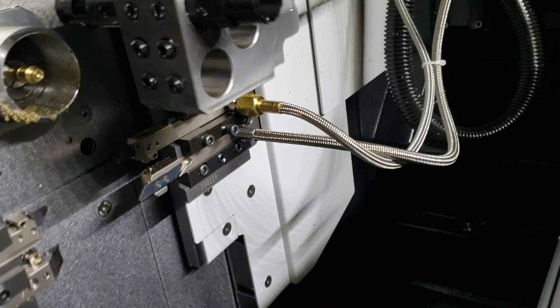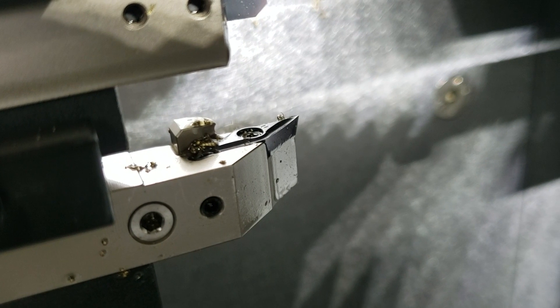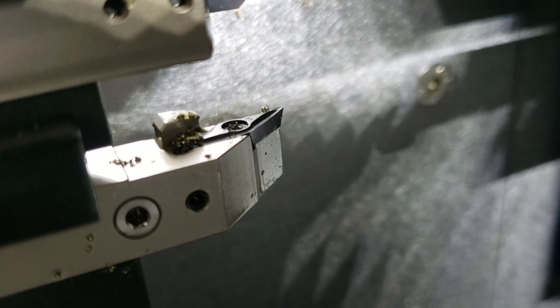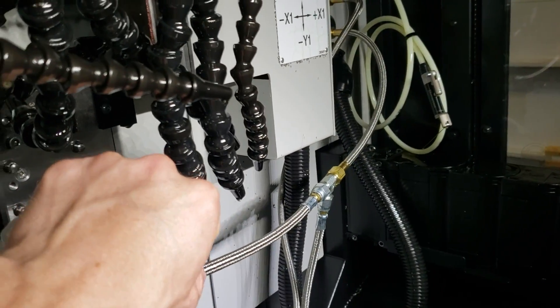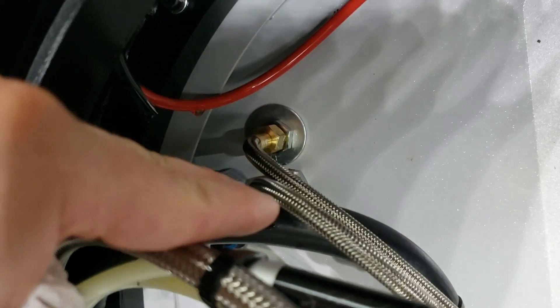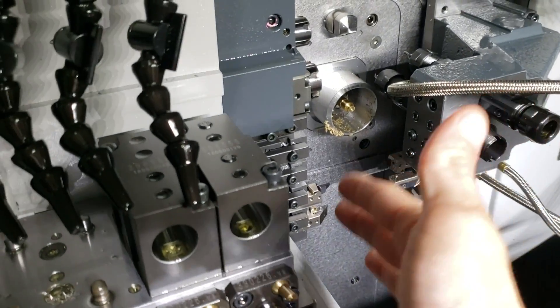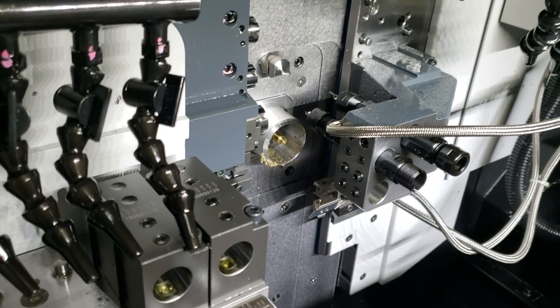All these tools have coolant going through the tool. Notice that block on top of the holder — there's a tiny little hole inside that'll shoot coolant at up to 2,000 psi; I was seeing about 1,800 psi coming out one of the nozzles. Almost all of the tools are going to have through coolant, and I've got a through-coolant drill bit teed to the parting tool. I've got manifold blocks so I'm going to tee them off. The final goal is five turning tools on this side, two parting tools on that side, and a bunch of drill holders all getting coolant.